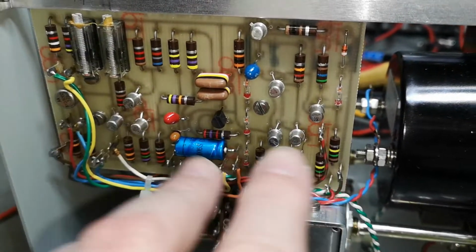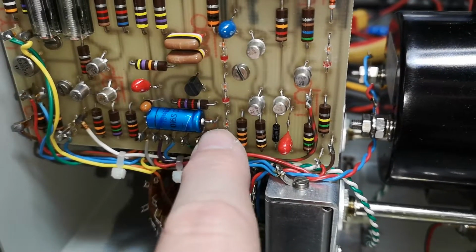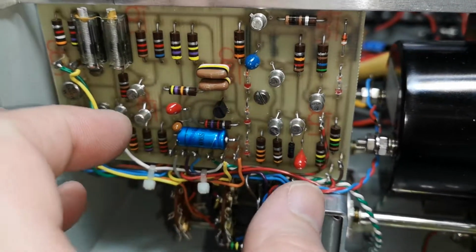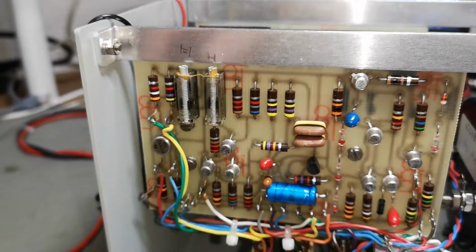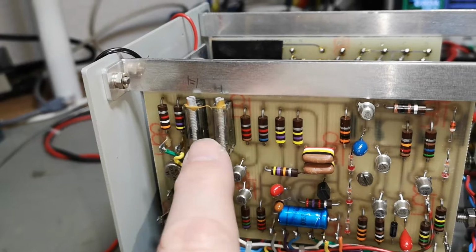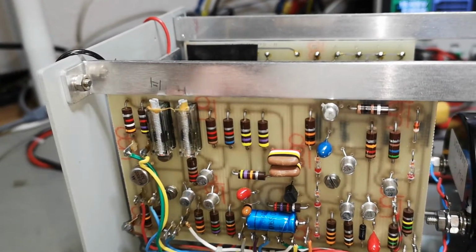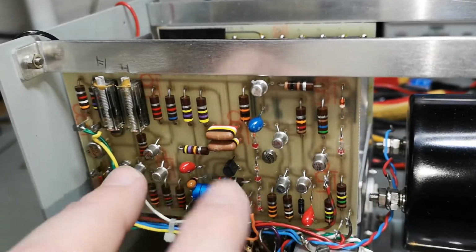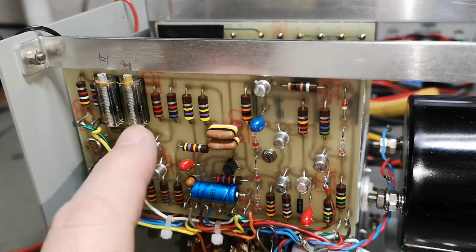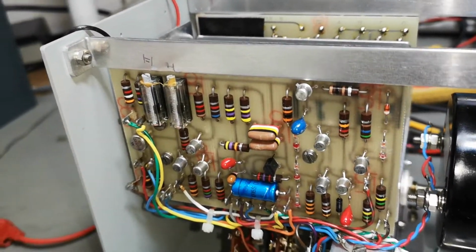So I thought, well, I'm looking for an imbalance. I'm looking for leakage in some of the capacitors here. So I'm like, okay, we just cut one of the pins in one of the sides here and then do a little bit of tweaking around and see if I can figure out where the leak is. And you know what? That is so stupid. The whole mistake. Those two trimmers. Somebody poked around with those without knowing what he was doing. And those are very, very critical to figure out how to do the balance in all this stuff. So why do people touch stuff they don't know what they're doing? That is, I know, not so smart, you know. But anyway, that's probably why this landed on my table.